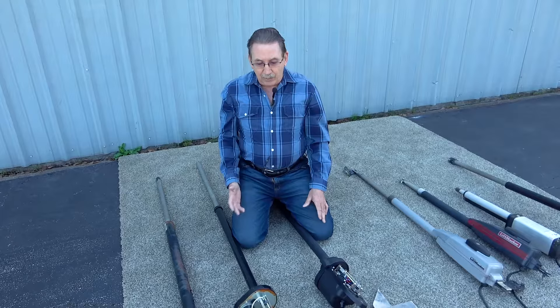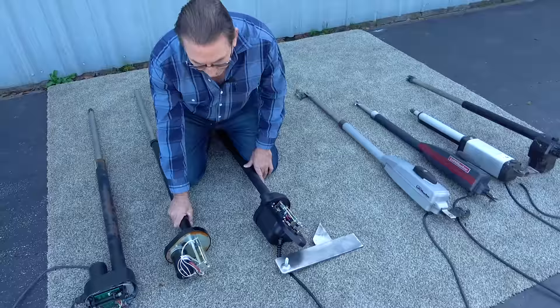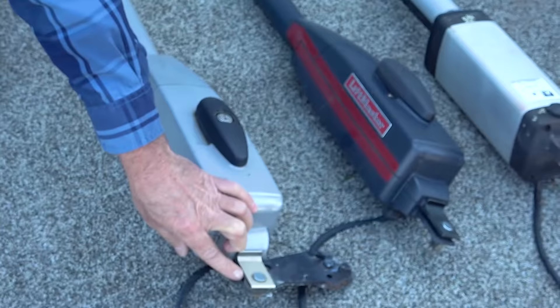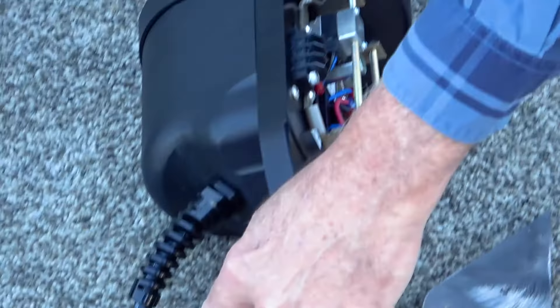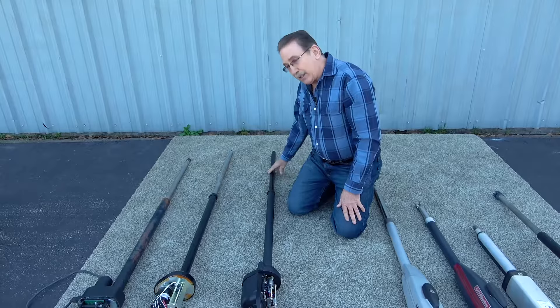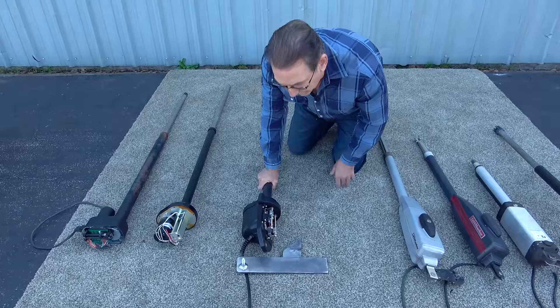About three years ago another company came out called American Armor — actually a guy who worked for Apollo started his own business. This is the strongest opener I've ever used. It's five-eighths inch here, and as you can see on the shorter arm openers the metal is very thin, down to about one-eighth inch. This thing is built like a tank. I also custom build my brackets — they're much heavier than stock, they grab further out, and they have an aluminum black anodized tube so the tube actually disappears with the gate rail. This is the strongest opener I've ever used.